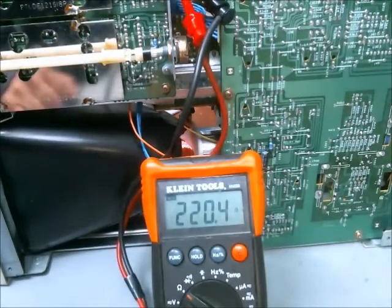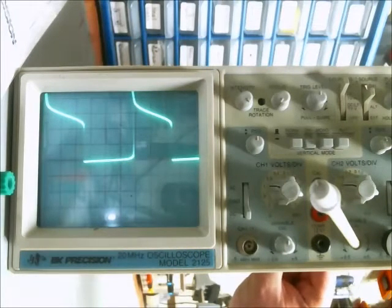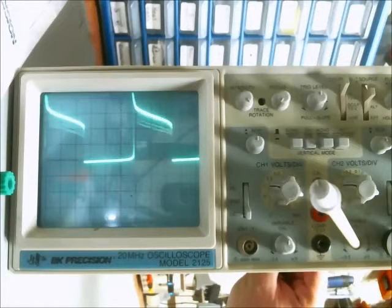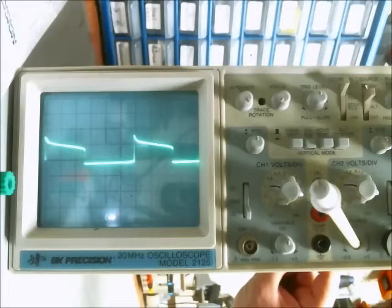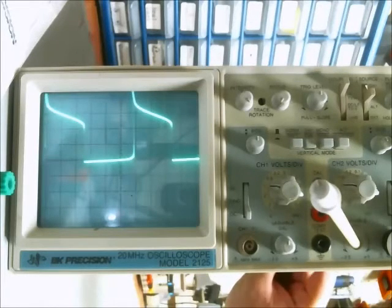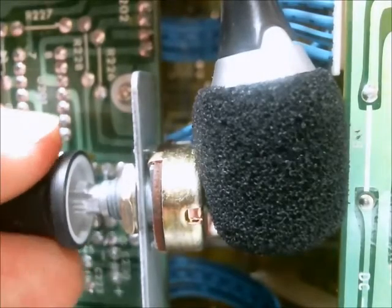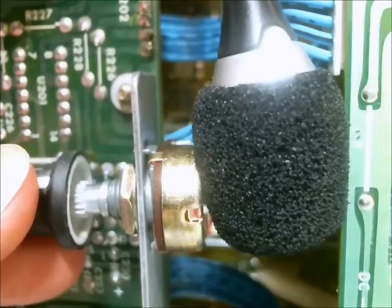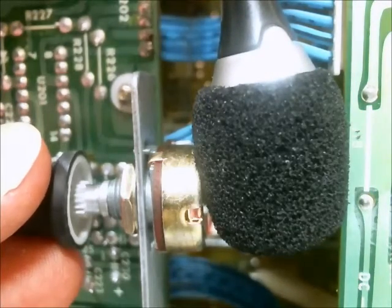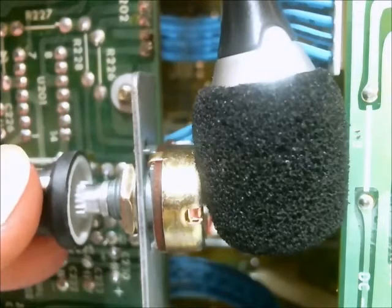Now I'm going to reattach power and make these adjustments by hand without the shaft to see if the issue is still present. The signal looks fine on channel 2, but it still jumps down to that small point periodically. It does seem a little more stable than before when the shaft was connected. I also noticed that turning the potentiometer in one direction is rather difficult — you can probably hear the sound of the sweeper running on the thin film polymer material. Going the other way there's no sound, but in this direction there is some sound.